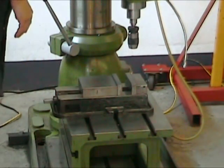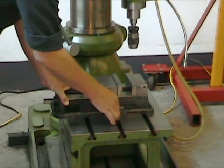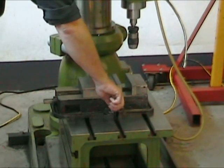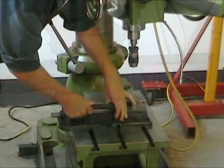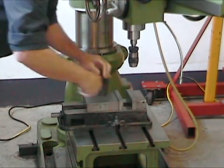This is a powerful drill press, and for that reason, we're going to be bolting the vise down solidly and using a rigid milling machine type vise. Since there's no XY axis on this type of machine, vise alignment isn't important, but line it up visually just the same, because a crooked vise really gives me cramps.